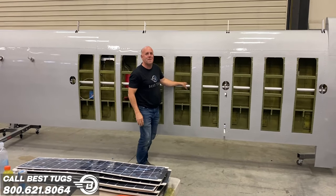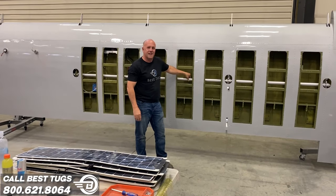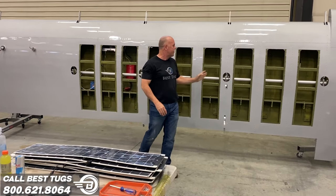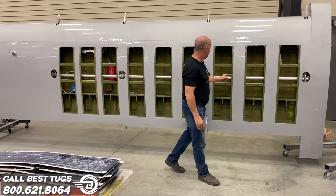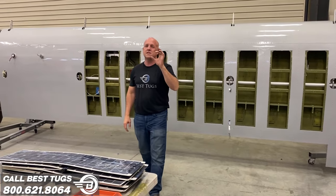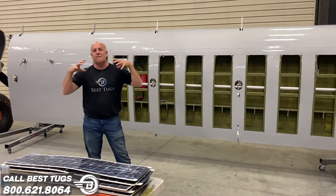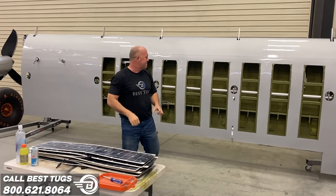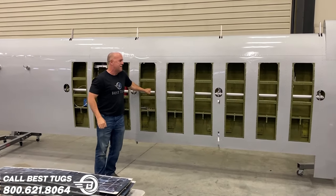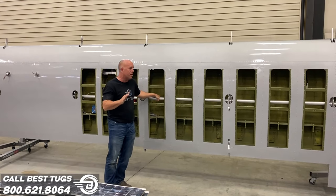So before I cover them up, you can see the wingtip to wingtip torque tube. This is all inset in a bearing bronze. At every one of these locations is the inset. Where it passes through the other ribs, there's over a quarter inch clearance all the way around every rib. So if there's any flex or movement, it can't make contact anywhere. The bearing bronze is unbelievable, no matter how much pressure I put on it. It is smooth as silk, no play.